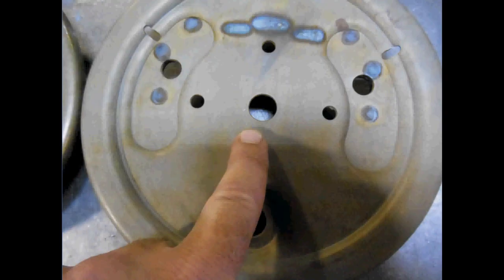Here we've got a stamping, and it's got about a 1/2 inch or 5/8 hole in the center right now. It's got a couple existing holes here, which happen to be 1/2 inch diameter, and we've got 3/8 holes here, and they are close to 3/8, .376. Now, if we look at this, we've got some dark marks, and I'll show you what those are from. That's some welded parts on the other side of this stamping. But what we need to do is open this hole up to 1 3/8, and then I've got to mill 2 very small rectangular pockets here.